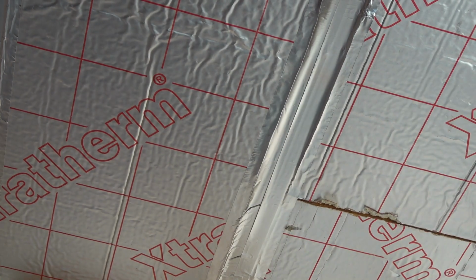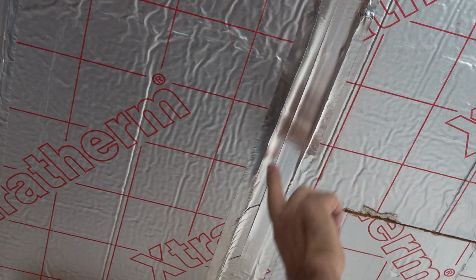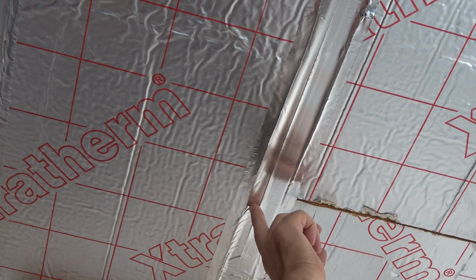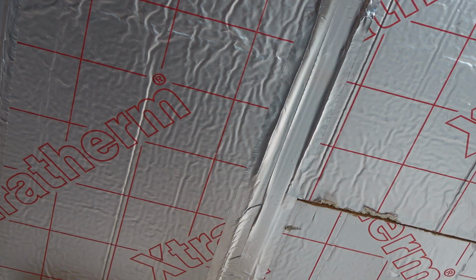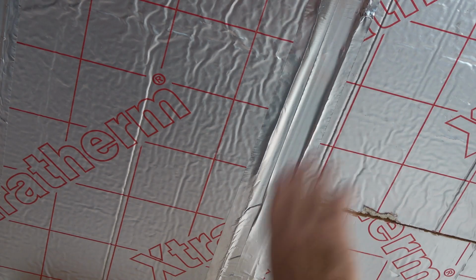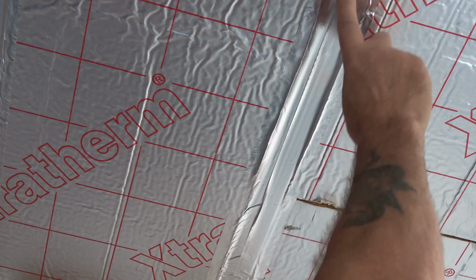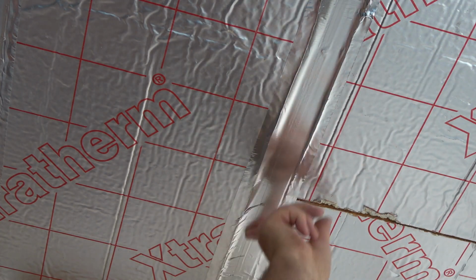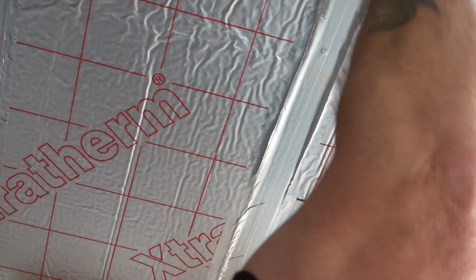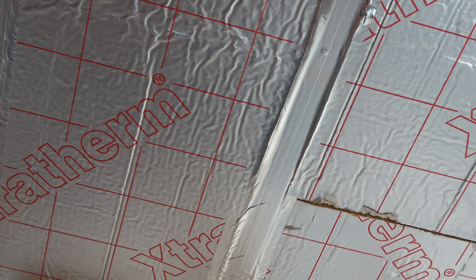Just briefly before I get some sticky stuff, you need to be quite vigilant. Can you see where that hasn't quite stuck? Once it starts to dry out, you'll find the adhesive's not going to be as good. So as you're applying it, make sure you seal all the edges, so it's almost invisible once you've done it. Same on the insulation side.